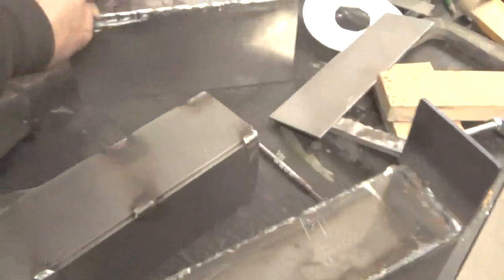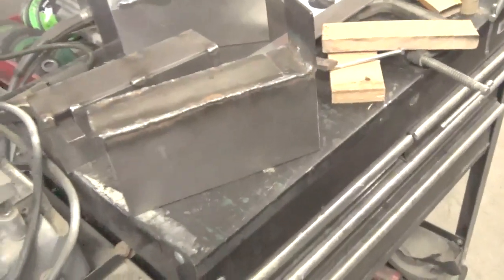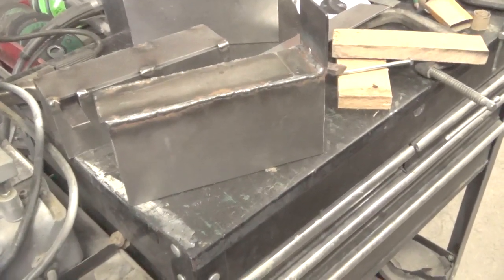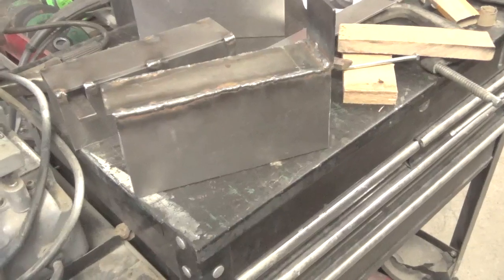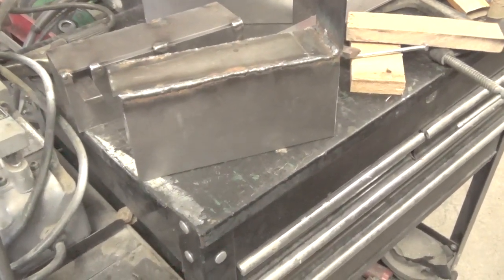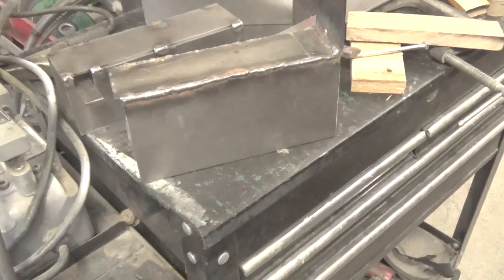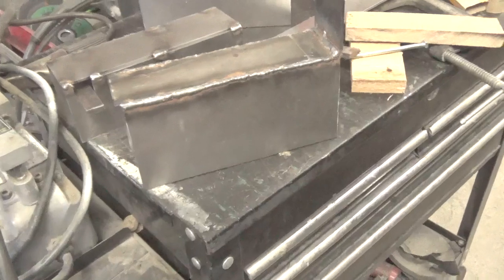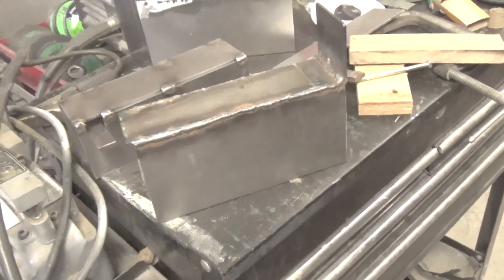Now when you set these bases on the bunk, what you don't want to do is set the base at the extreme end of the log on each end. What you want to do is try and get it in, like say if you have a 12-foot log, if you could come in a foot or two on each end, that would be ideal. An 8-footer, if you come in a foot or so, 8-footers aren't too bad. Usually the cant doesn't bend that much as you're going down.